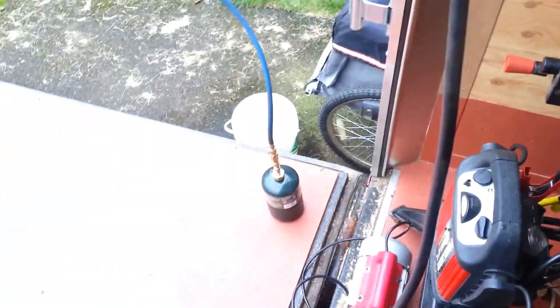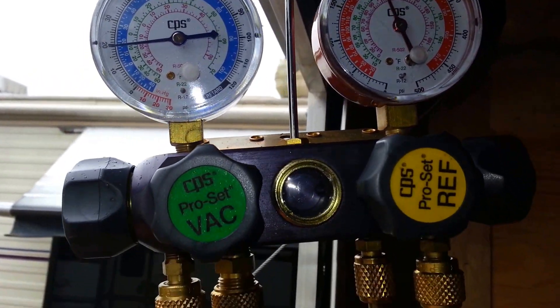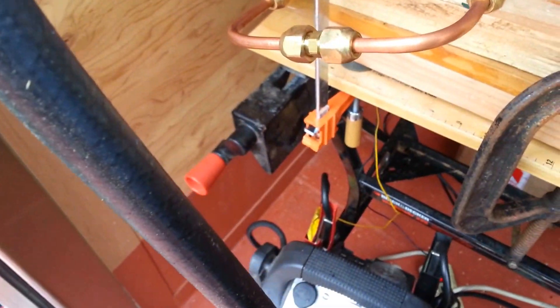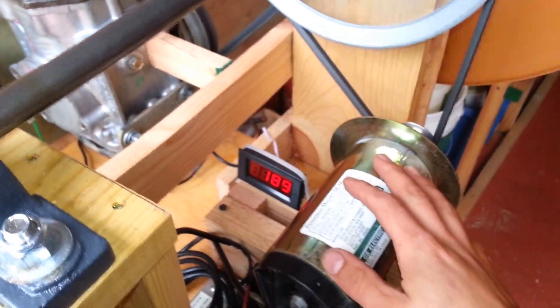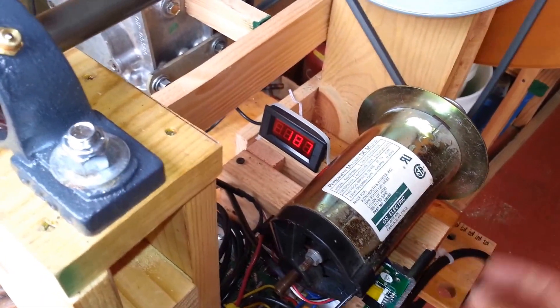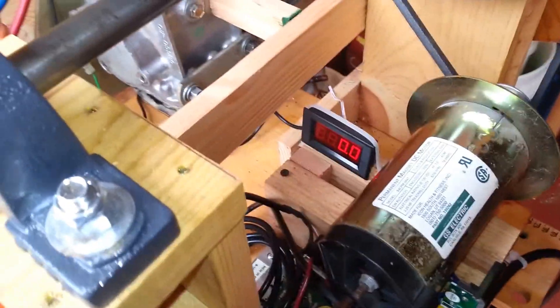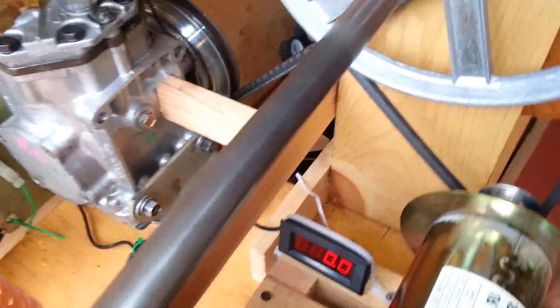I've got a big flywheel on here. We're running with propane right now — barbecue-grade propane. We've got quite a compression ratio: up to around 225 PSI on the high side and about 20 PSI on the low side. We've got a treadmill motor, 2.25 horsepower, DC motor — I think 130 volt DC. You can see we have a tach right there; the tach sensor is mounted on the other side of the compressor. There's a magnet on the pulley, so it reads the final drive.